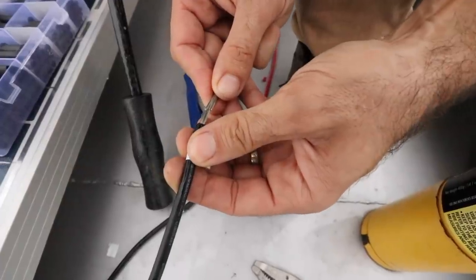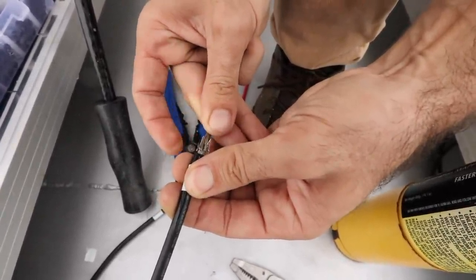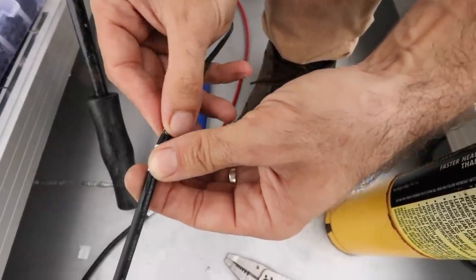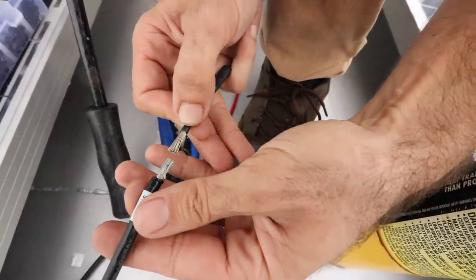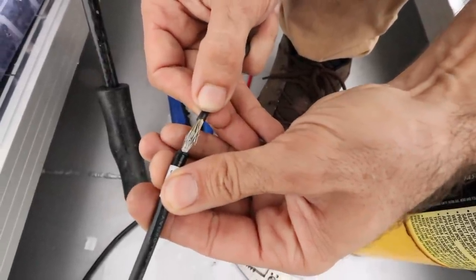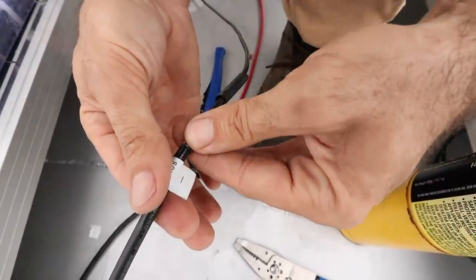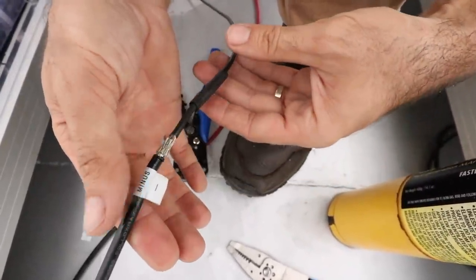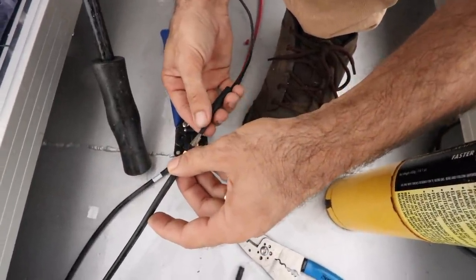When you're splicing your wires together, don't twist them, just press them together. It's a wee bit messy, but like that. Let's do that again. There we go. Push them together like that, then tap them down, and then you can solder them like that, and that gives you the best possible mesh of the cabling, without having a huge blob as well.